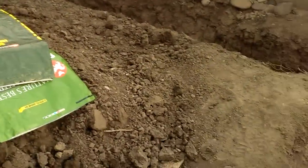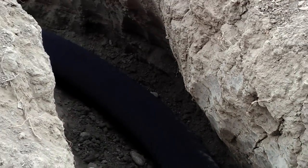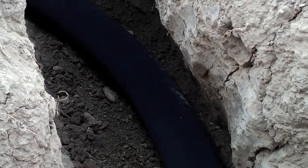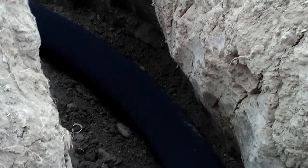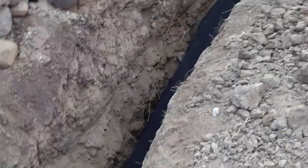We're putting in the first geo tube, which you can see in there. It's drain tile with a sock — that's actually what it's called in the construction industry. It's a four-inch corrugated plastic pipe with a nylon sock on it. We have it set at 48 inches depth for the first run. There'll be another run 12 inches above this in a different pattern, but we'll discuss that in a different video.